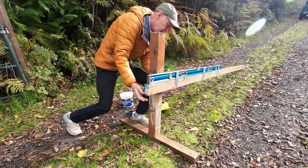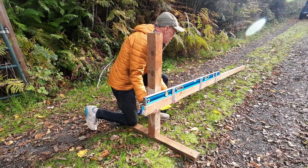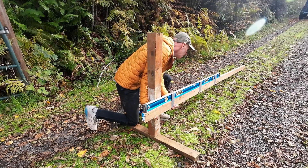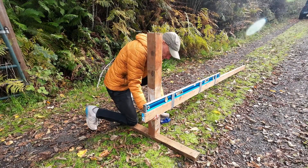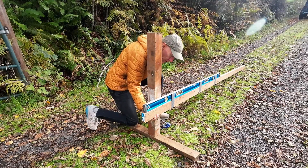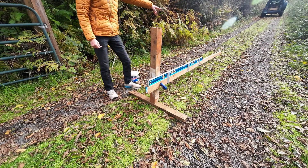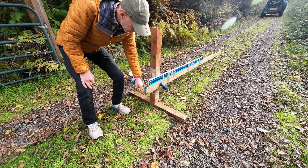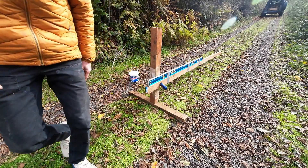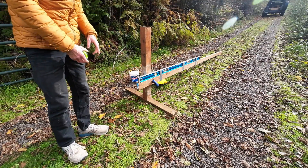Because I only have one set of hands to work with, I'm using this T-post so that I can position the bubble, get it level, and then use my speed clamp to anchor that. Now I've got it set up and it's level. It's 144 inches from the center of the grade out to here. I'm lining this right down the center of the driveway — as long as I pick something consistent, it should work.